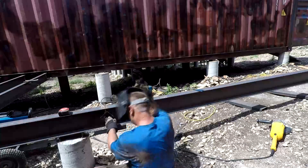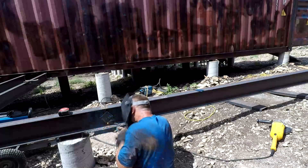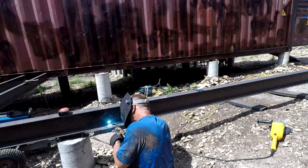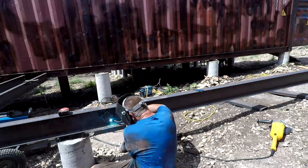I'm putting on a quarter-inch thick wall plate on the inside of the beam — fully welded in. That makes a much stronger joint than just doing seam welds on the beams alone.